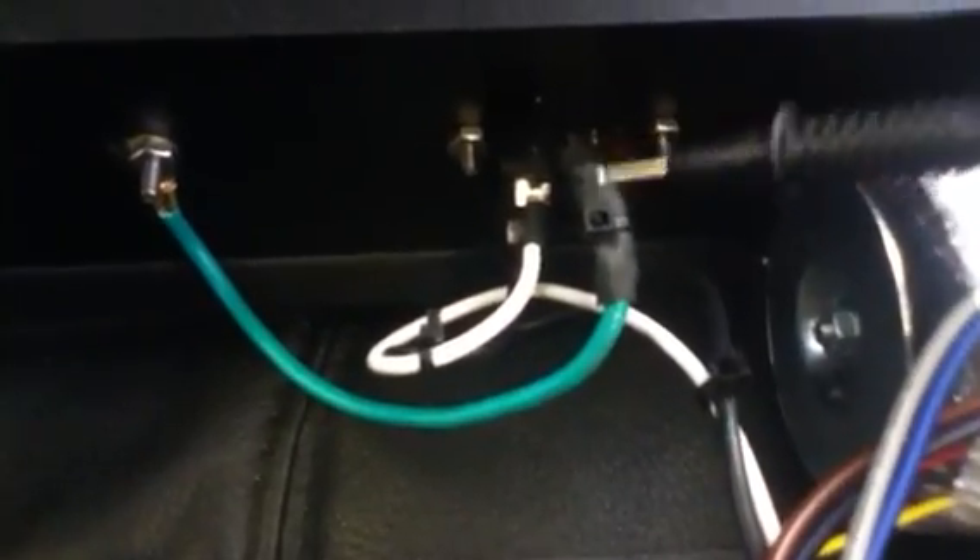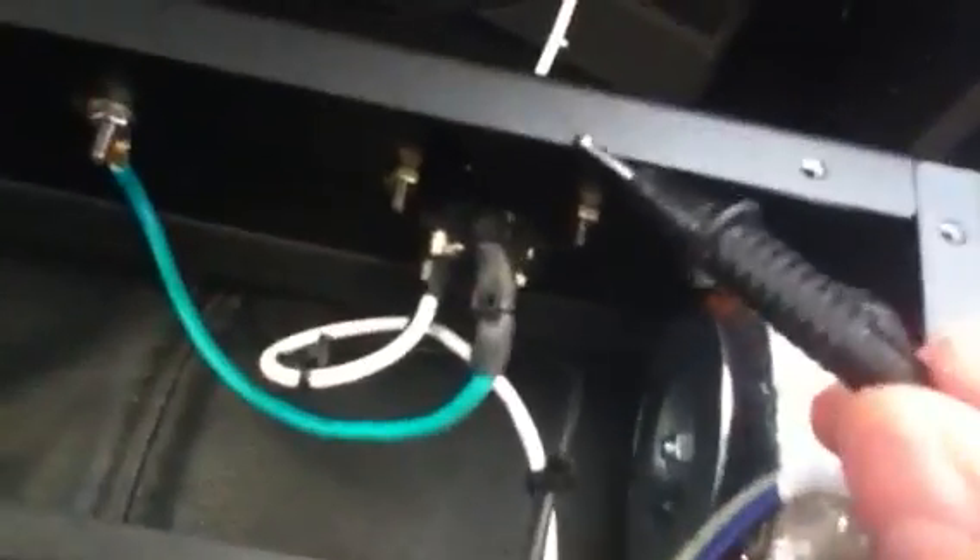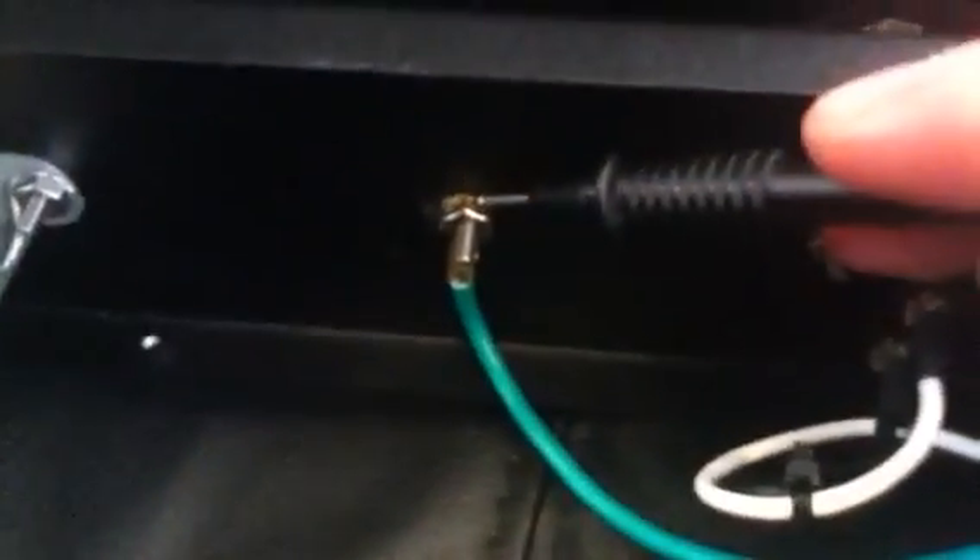Another important ground is your power ground pin — that's your number three ground pin here. That grounds into the chassis and that's for safety; you don't want anyone getting shocked. The ground pin comes off and I have it going into a bolt in the chassis. I scraped the powder coat there too, so it's grounded right into the chassis — a complete ground.